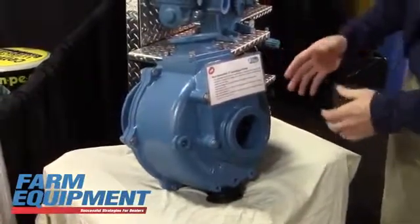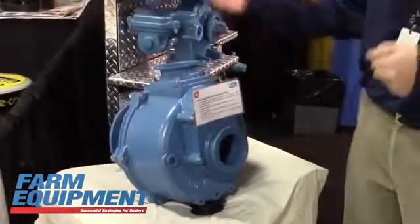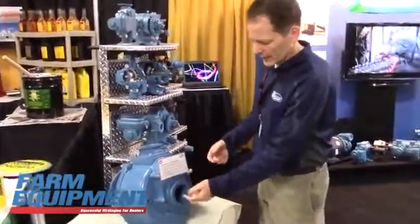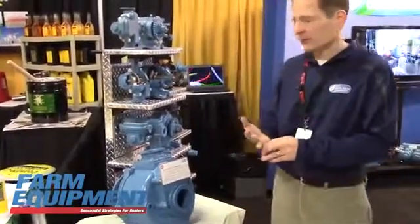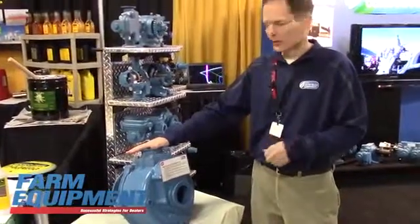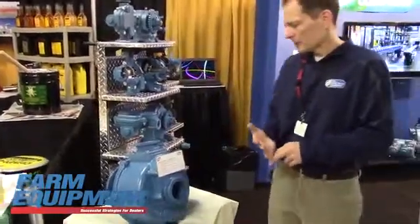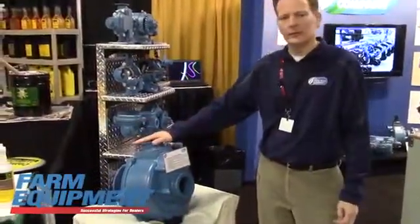There are various reasons why you might do that. When you have the inlet up high, the fluid that you've pumped up into the outlet line can drain back through and you don't have the outlet line full of fluid. Or you can do it the other way and get higher flow by having the center inlet. We're going up to 400 GPM now when using a 13 horsepower gas or a 15 horsepower electric on our SP pump. You can also have a 10 horsepower pump with a lower max capacity, but 400 GPM is what we're up to on this now.